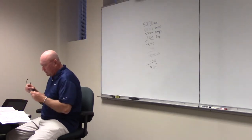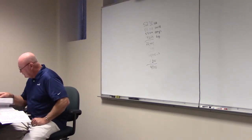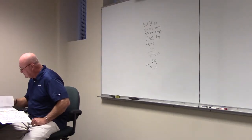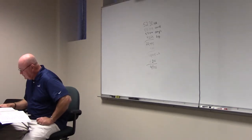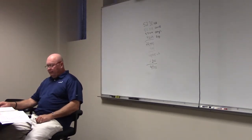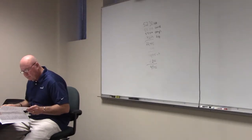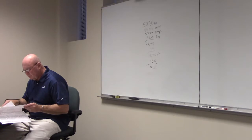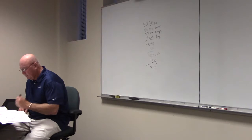Matter of fact, let's turn to 230.79(C). Let's turn there and see what it says. I've marked this. 230.79(C) says what? Somebody read that. One-family dwelling, the service disconnecting means shall have a rating of not less than 100 amperes. Yep. 100 amps. Okay. So there we go.